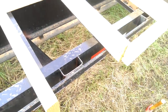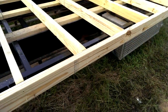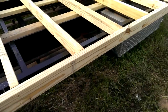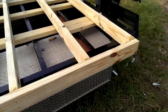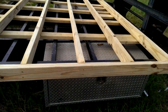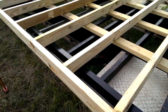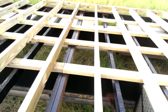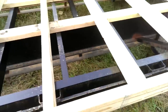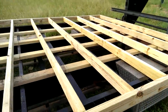I'm even scared to put it three and a half inches over the edge — I'd think that'd be too much weight bearing down and it would eventually bow. I'm going to be welding on a three by three angle iron piece underneath each joist. It's not going to be sticking over but two inches overhang on each side. I feel safe with two inches because I'm not just putting down a two by four foundation. I'm putting down one and one eighth inch Advantech OSB — the super floor. You could probably build your house strictly out of that stuff and it would stand.